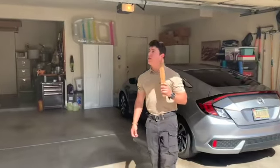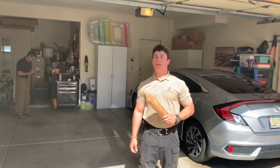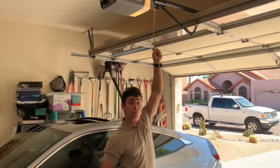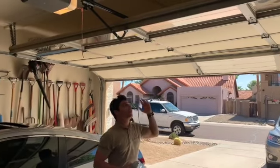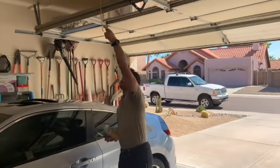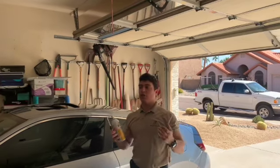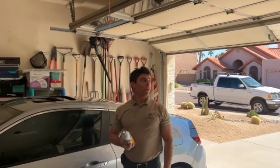So that tells us that the door is operating safely. Now we're going to talk about general garage door maintenance as well. It's important to have a manual release for emergency purposes on the garage door. As you can see here, the red handle has actually been removed because on doors where there are glass panels, burglars have been known to hook a hanger around it to access the handle and get into people's homes. By removing the handle, you're actually reducing the likelihood of a security breach, but can still pull the door for a manual release.